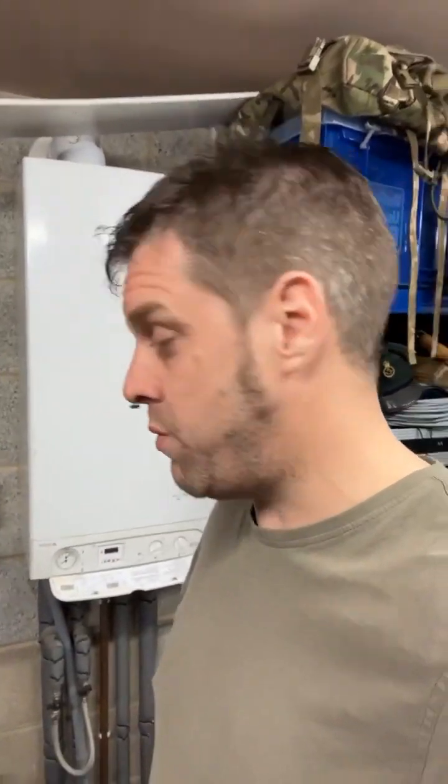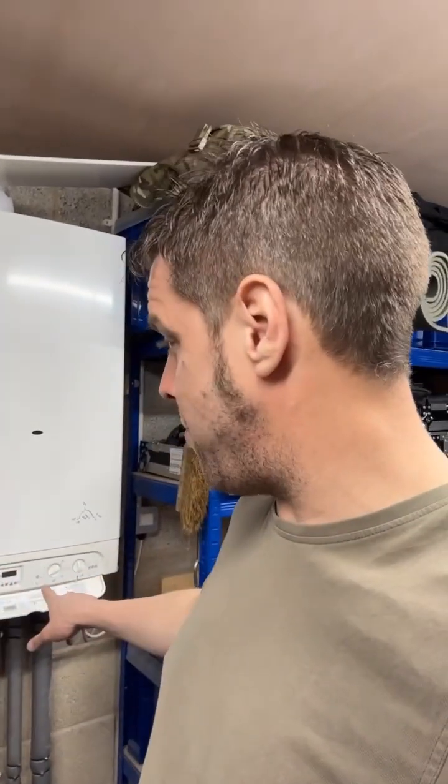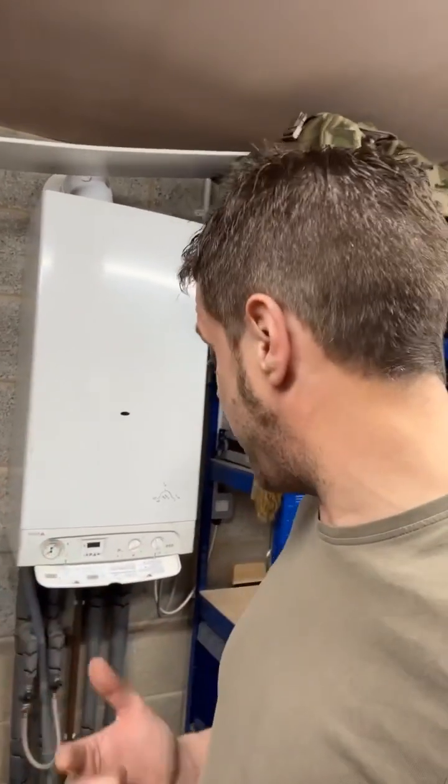At the minute my boiler just heats the entire house. The flow goes out, goes into a tee to the front and back of the house, which I can adjust, and then it comes back. I haven't got upstairs and downstairs separate as I'd like, but it's not worth separating them with the house all finished. I'm going to fit an outdoor temperature sensor plus flow and return sensors, and possibly an internal one too.